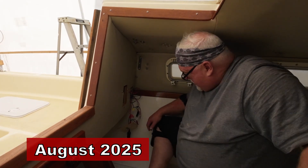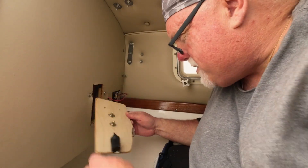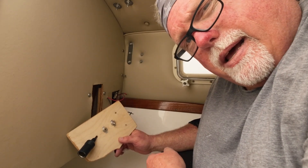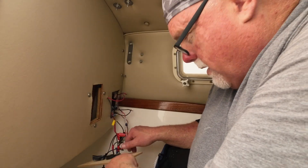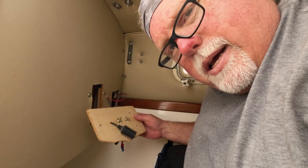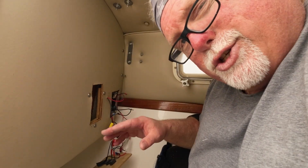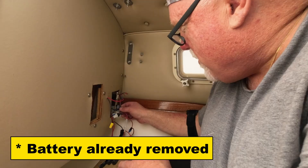There's just not a lot of room inside here. This is the original electrical panel. It looks like they had an outlet to plug something in, and then two switches — presumably for the masthead light and the running lights and nav lights, so you can use the boat at night. Our new electrical panel is going to be just as simple, but instead of improvised wood, it'll be a store-bought panel. Before you remove the old panel, make sure you mark what wires go where — that'll save you a lot of trouble. Somebody already did that, so we're good.